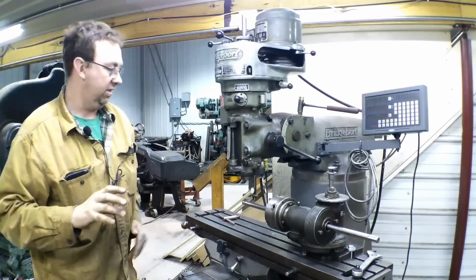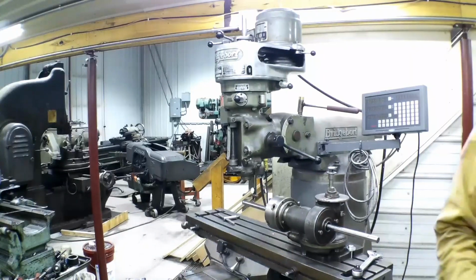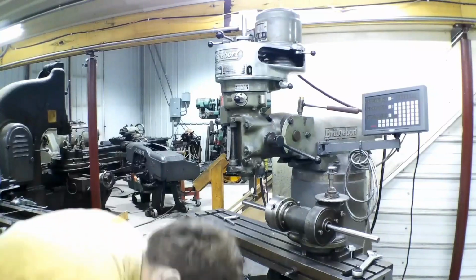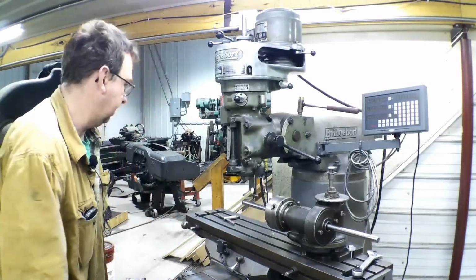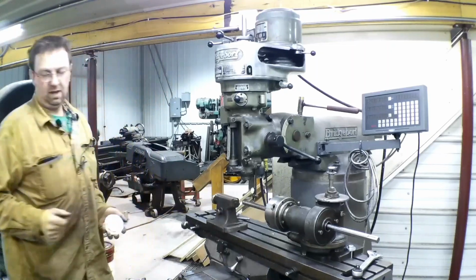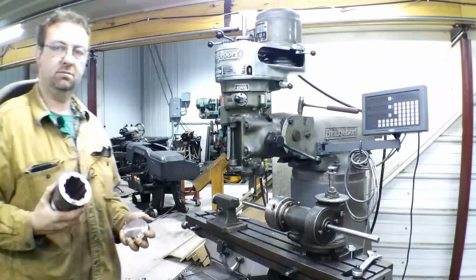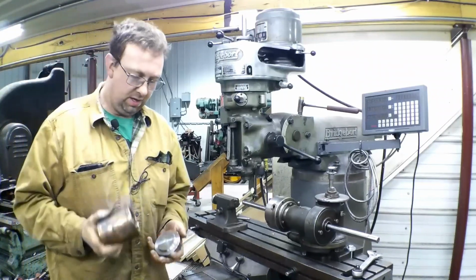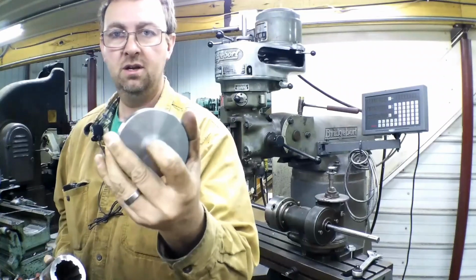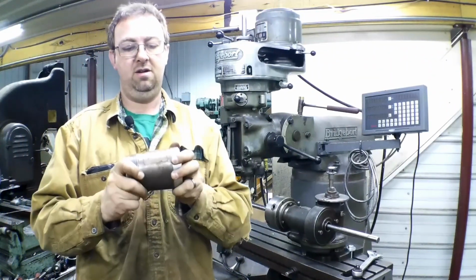With that, now we set up our tailstock for the dividing head, which is right here. Get that cleaned up. And in order to do this job correctly, okay, I think I'm done bending over now. I made this plate, this adapter, center drilled for our tailstock, and it fits in here nice and snug.